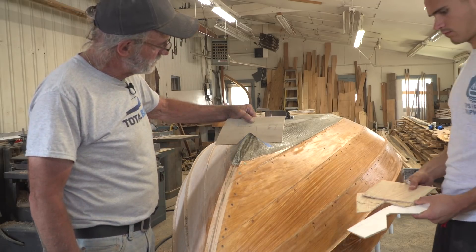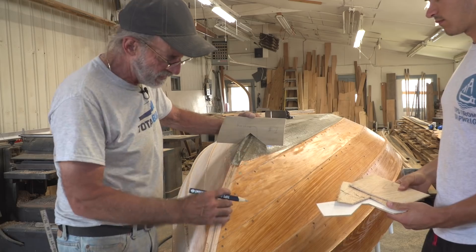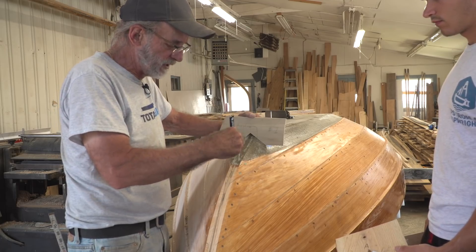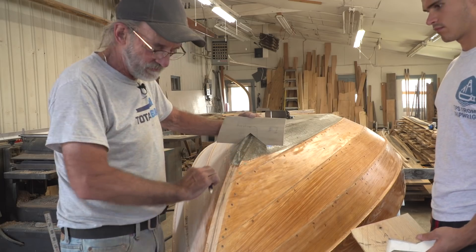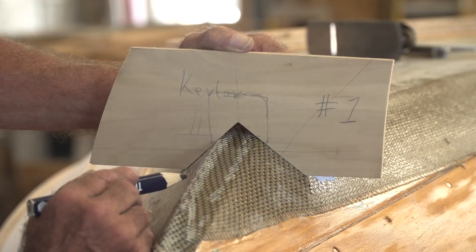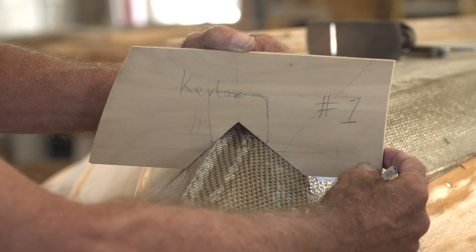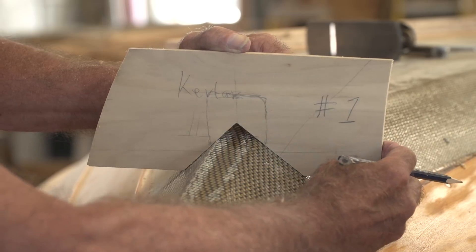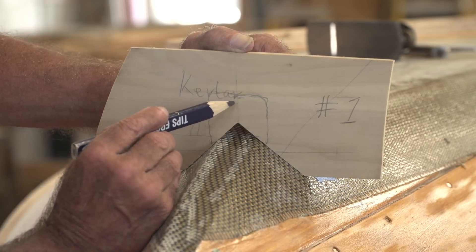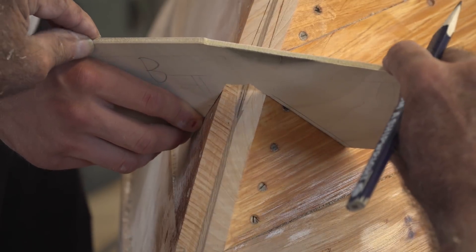We've prepared our laminates for the stem cap, and before we glue them up and bend them around, we've made up these little marking jigs. When you put the laminates on there it's difficult to find the very center, because you could center a drill hole on the top laminate and it won't be on center once you whittle the stem cap down to shape. So we want a way to mark the center. The way these work is: after you bend the cap around all glued up, you pop these jigs down over the cap and make sure they don't slide back and forth. They fit right in position, and there's a centerline on them that we transfer onto the top laminate — that's where we drill our screw hole. Caleb has made a number of these for different positions, coordinated by a mark on the planking.